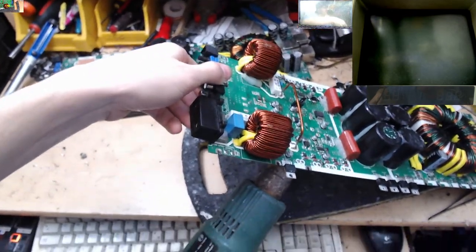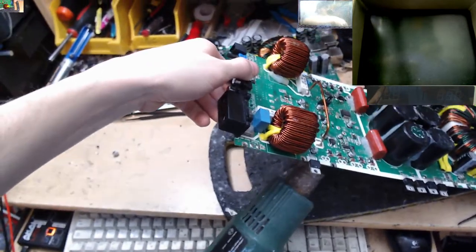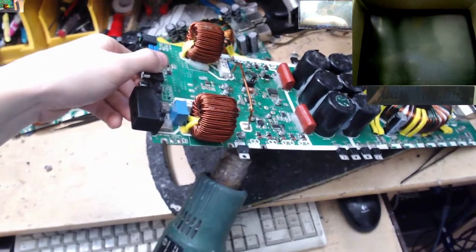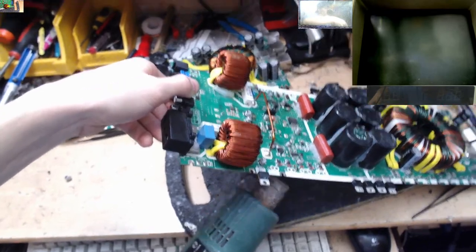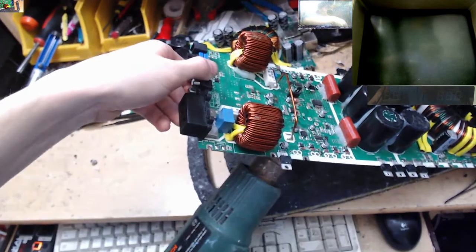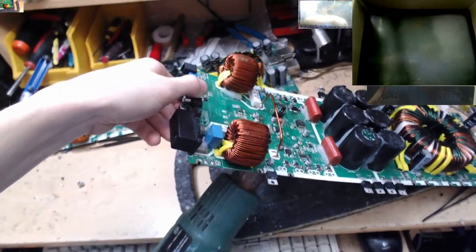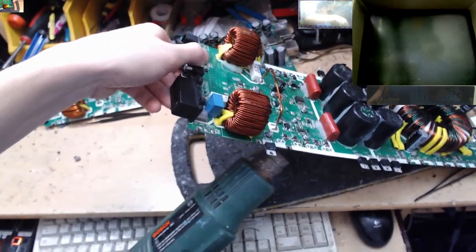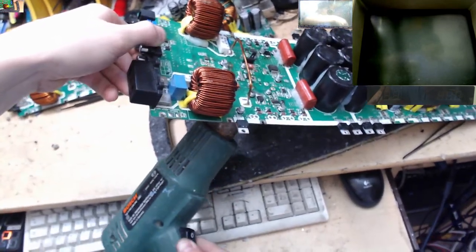Dr. Diner says, what's the difference between the 1-ohm and 2-ohm versions? So Melky pretty much nailed it. The power supplies are the same, but the transformer on the 2-ohm version will have more turns on the secondary, or fewer turns on the primary, and there will be a higher output voltage on the output section, and it will have a lower current ability on the output section. So it's just literally a balance of voltage and current for the given impedance. So yeah, Melky is correct.